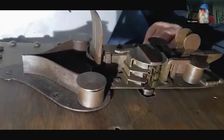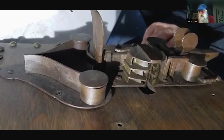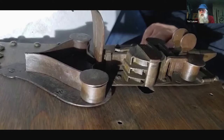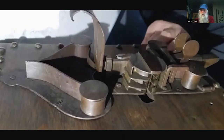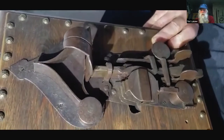This video shows the key entering the ward box on the pin. You can see the key has been cut to fit around the wards — all those wards run the complete distance around the center pin. Sometimes you see just little fingers, but these are concentric rings that offer the most protection.